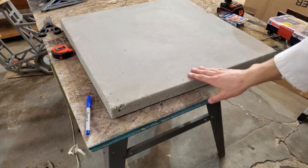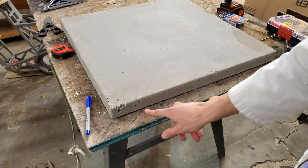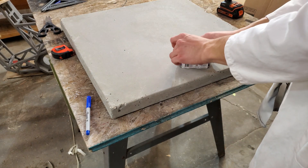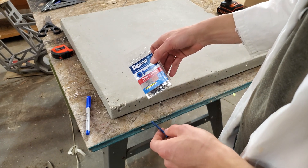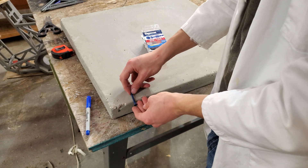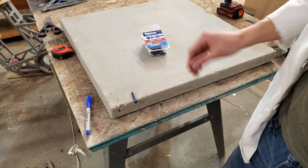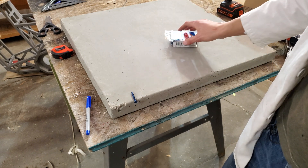The idea is the plywood box is going to be secured to this concrete slab from the sides by the use of some custom-made brackets. The brackets will secure to the concrete using Tapcon concrete screws, especially designed for the purpose. So I need to drill and pre-drill these holes into the concrete — I need to drill a quarter inch extra. And for a 3/16ths Tapcon, I need a 5/32nd bit.